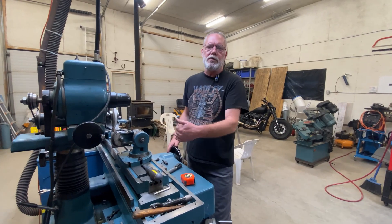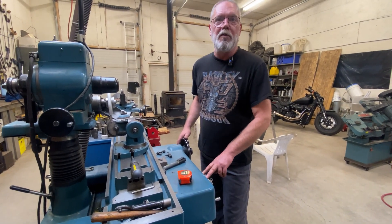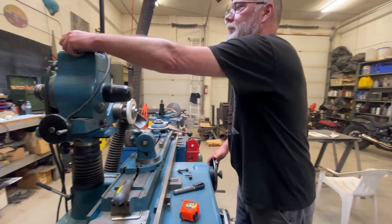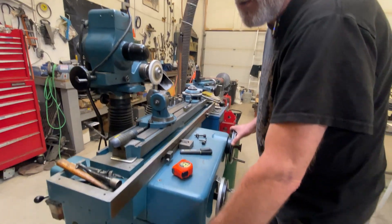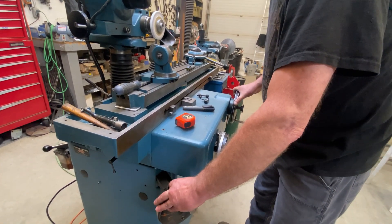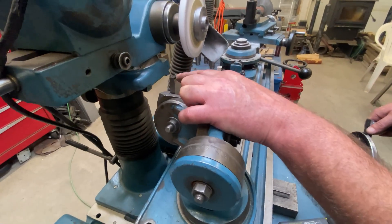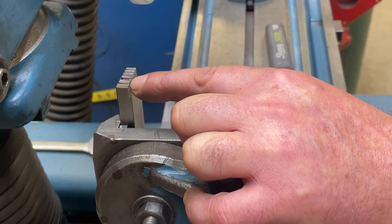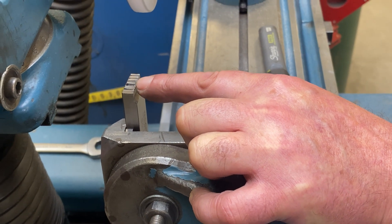Now that I'm centered in and out, I've locked the travel on my table so I can't make a mistake and move this. I really would not want to move this because it's in the perfect place and needs to stay exactly there as I sharpen all four of the dies in this set. I'm going to go back and forth past the area I want to grind and come down super slowly until I just touch, then pull the tool out and take a look. That entire surface completely cleaned up after having traveled downwards only one thou, so I'm going to call that just perfect. Now I need to keep grinding until all the black disappears - what you see in there is the actual damage and wear on this cutting edge.